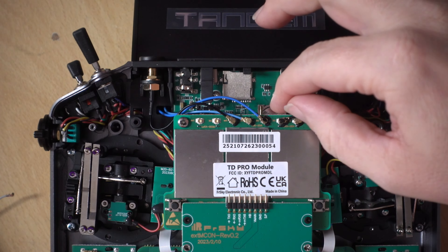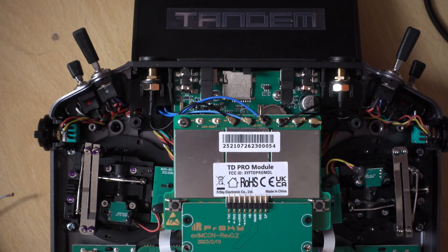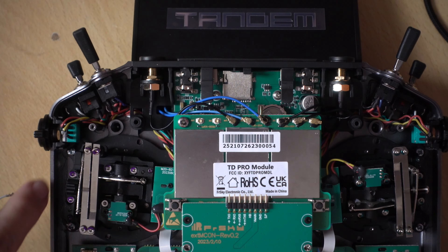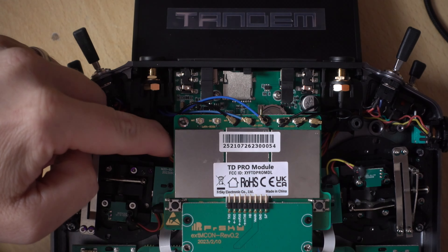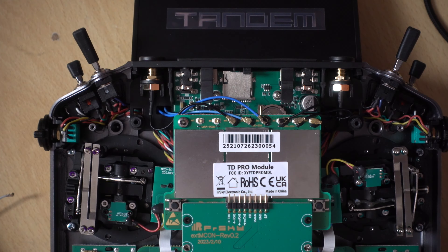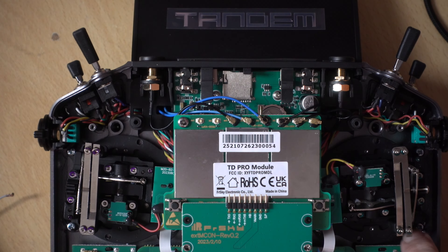It might be able to come out without removing that. So that is the first thing you may need to take the back off for. The other is rotating these gimbals — there are just four screws. There's one in there which you might just be able to see and another just under the ribbon cable, and you can get to all of them without removing anything else. You just undo them, rotate the gimbals to where you want them, and tighten them back up. Don't over-tighten because this is just into aluminium — you don't want to rip the threads out.